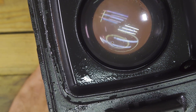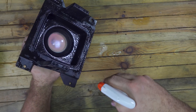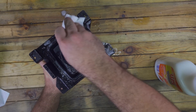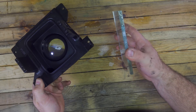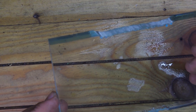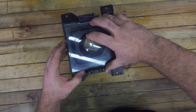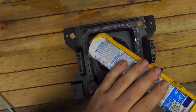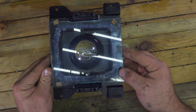Now you can see that the lens is very interesting — it's weird. It's like a concave lens and right now it doesn't have any effect; it's not a fisheye lens, not even a macro lens. So let's take some soap and water and tissue to carefully clean all the oil from the surface of the projector. I want it to be very clean because I want to glue in place a very thick piece of glass, which will replace the CRT monitor. I cut it at the right dimension, and to glue it in place I'll use some normal silicone, making sure to make a very straight line without air leaks so we don't have water leaks later on.